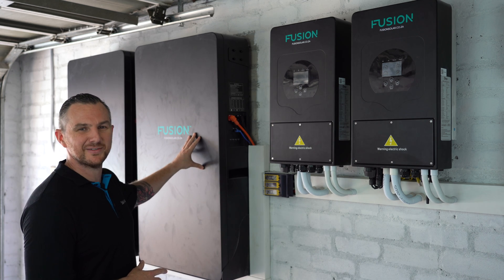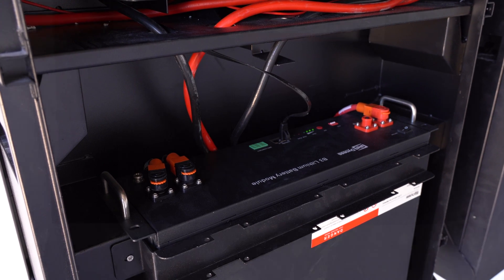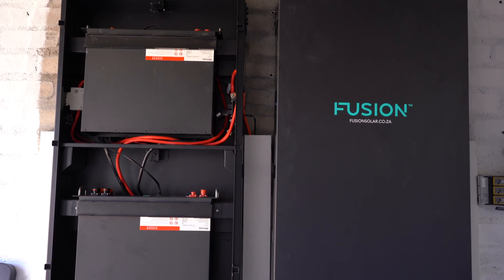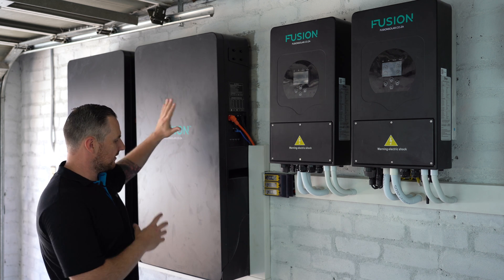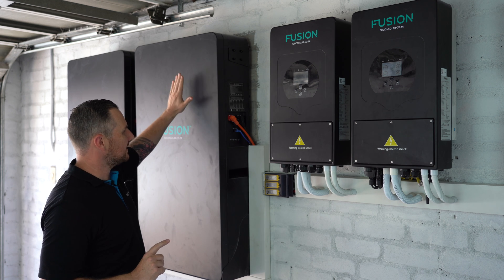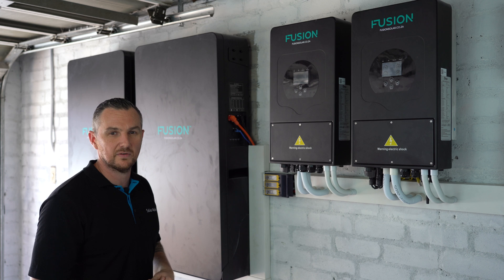Moving on to my batteries — they may look massive but there are basically two 3.6 kilowatt-hour batteries inside: one on the top and one on the bottom, plus another one down here, which equals 14.4 kilowatt-hours total. One thing I love about this cabinet is that you can take the front off — though I'd recommend getting a qualified installer to do this. It looks neat and tidy and the batteries are rack-mounted inside, stacked vertically and connected together, then connected via a disconnect switch to the inverter.